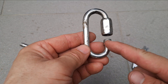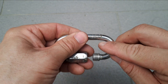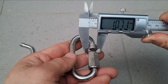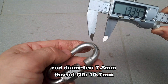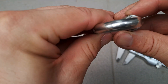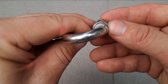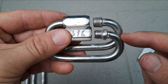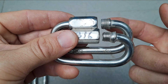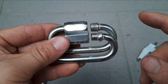Here's another stainless steel quick link — you can see the threads are a lot wider here. This one's actually rated to 25kN. These threads have an outer diameter of 10.7, versus 7.8. On this one rated for 25kN, as we start threading up the nut, there's really not a lot of gap. When you compare the two — this 316 one and this other rated for 25kN — you see the diameter of the threaded area is quite different from the rod stock.